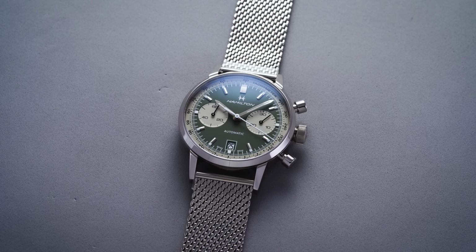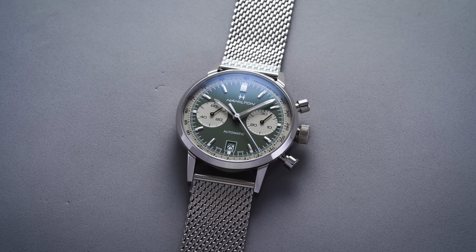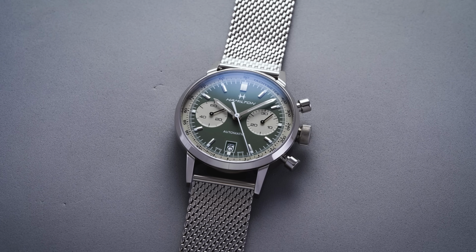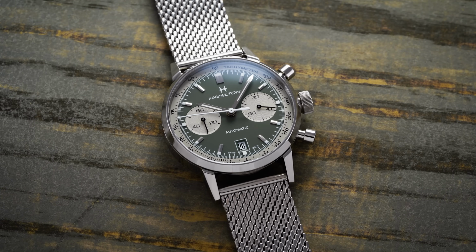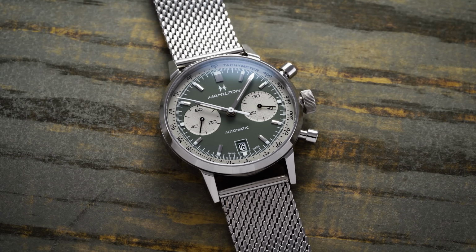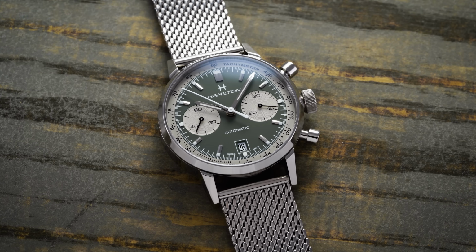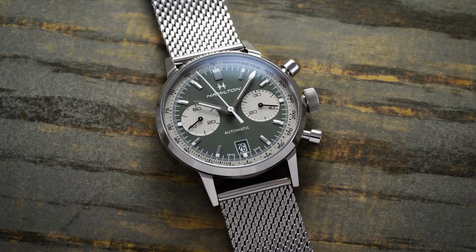A prolific chronograph caliber that has been reworked and improved through a series of modifications to the gear train and balance assembly to allow this one to have a power reserve of 60 hours compared to the 40-hour approximate of the base, all while not having to slow the beat frequency of the movement, which is usually common practice with many of the other Swatch Group brands and counterparts.